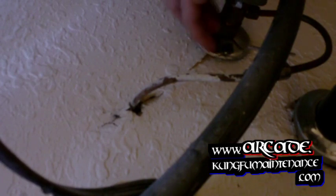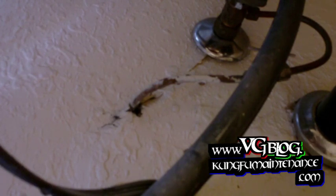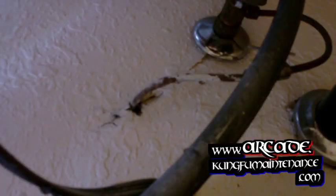And there's going to be a bit of water left in the line, so just divert it into your paint can or paint tray or a rag. Now up top, I'm going to flip my basin wrench to loosen, and I'm going to remove the supply line from the hot side.